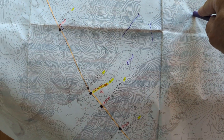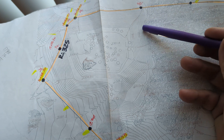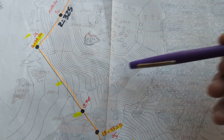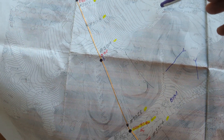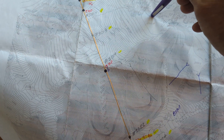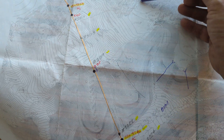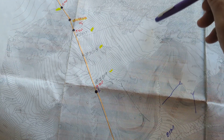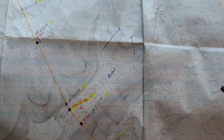Hopefully that helps with the question of how to read contours or an aerial. If you're doing a job, this is what is to be staked, and then you can check a contour if you need to catch a slope. If you wanted to check an elevation, you could verify your GPS elevations match. You can see where you're at on the map - if you knew these were spoil piles, you should hit a 2319 or 2320 elevation right outside the spoil pile. It's just verifying your work before you begin.